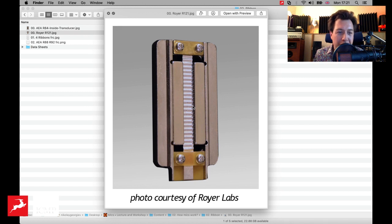A lot of people will argue that the ribbon mic is also a dynamic mic. But a key difference between the moving coil type and the ribbon type is that with a ribbon mic, you've got no metal coil attached to the back of the ribbon element. This means the element can actually react in a more faithful way to transients. I'll go through all these design features and then get back to comparisons — this is a very important point.